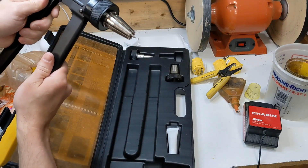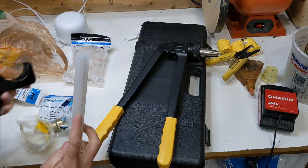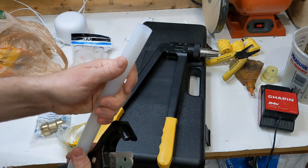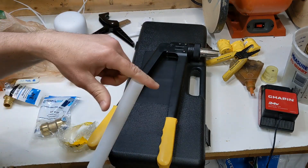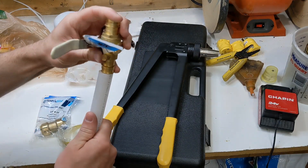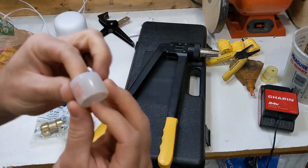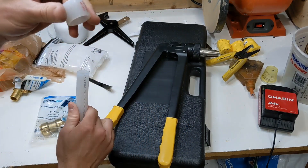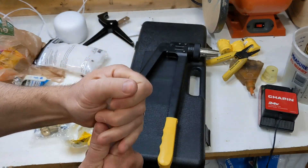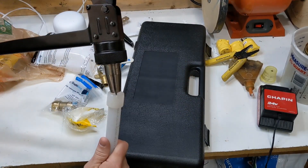I'm going to see if I can cut this square. It's not perfectly square, but it's better than what it was — at least it's straight across. If it has a slight bend, I don't think it will matter. If you notice, this does not fit on there — that's the point of the whole system. They have a lip on one side, slides across. Mind you, this is the first time I've ever done this. Pretty tight — you can't push it past that. Once you get it all the way on there, you proceed to this expansion tool.